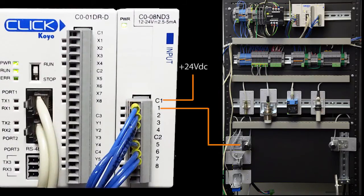We handle the optical sensors exactly the same way. We have a through beam, diffuse and retroreflective sensor, but all we really care about is whether they are NPN or PNP. The through beam is NPN and the other two are PNP, so we connect the NPN sensor to the I/O block with the positive common and the PNP sensors to the I/O block with the negative or grounded common.